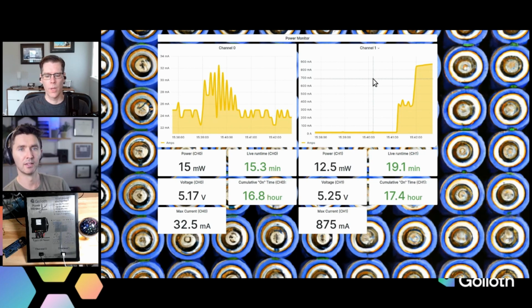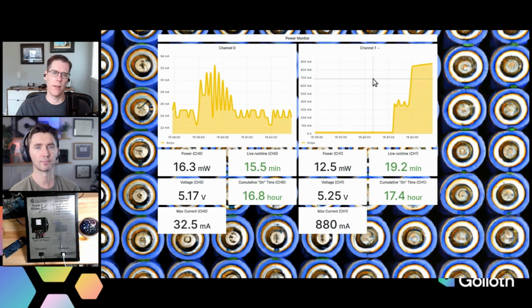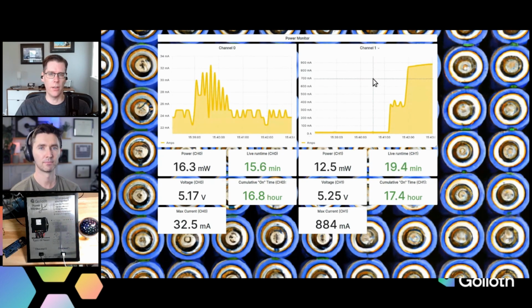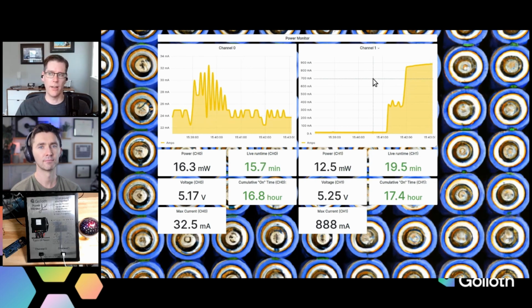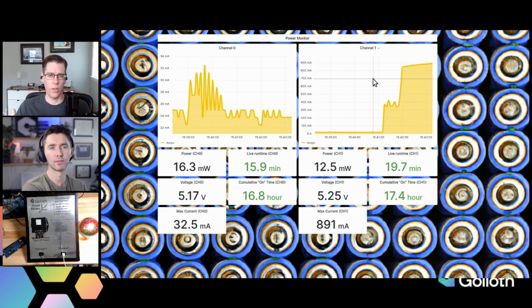Yeah, and I think one of the interesting things when you start to look at reference designs and the power of reference designs is we design some things in here that you might not immediately think about. So for instance, it is a cellular application, and so we set up the ability to cache your readings and send them all in one packet when you get signal again. And especially when we were showing off the GPS reference design, this is a great use case because you might have something out of cellular reach, and the GPS has really precise timing on it. You can timestamp your data that way.